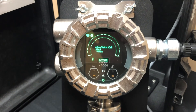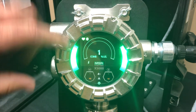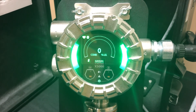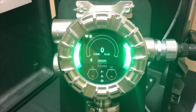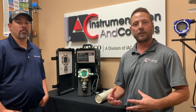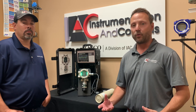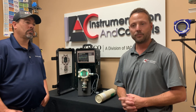Those are in your manuals — you can look to see what sensor works for what types of gas. This is a propane gas; you can see it's still seeing a little bit of gas, but as that clears away it'll go down to zero. That's pretty much the calibration process through the transmitter and push button menu. We'll also be going through the same process with the Bluetooth app. That was a quick overview of key features on the MSA Ultima X 5000 — a full calibration, as you saw, is very easy and very straightforward. If you have any questions, feel free to reach out and give us a call. Thank you.